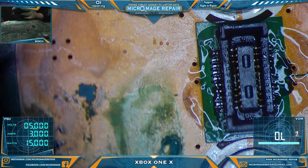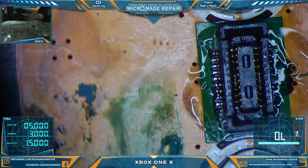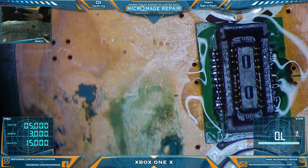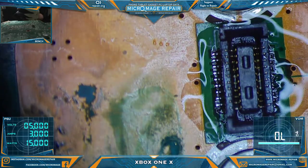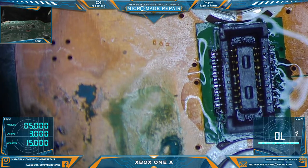I'm thinking about how to approach this best. I think I'm going to lower the airflow on this to about 60. I know I didn't put that on the temperature card, sorry. And we'll try just with rapid airflow to get this to solder in place. Otherwise I'll have to do some protecting on the other side. Nope, I think we're already seeing melting. That's not gonna work. We're gonna have to do it from the other side.